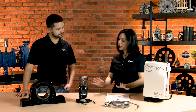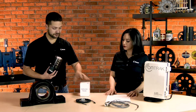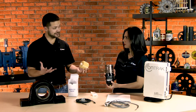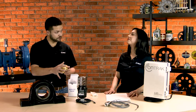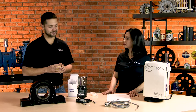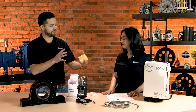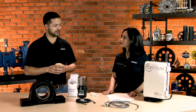So where does the grease come from? This single point lubricator, like many others, has a grease cartridge. Here we have it coming in a service pack — this is where you get the initial amount of grease. Every time you need to add more grease, you'll get a package like this that comes with a new battery and a new grease cartridge. Once it's installed, it's completely closed off from the environment, so contamination is minimized. It's marked properly so the right grease goes into it — you're not mixing different kinds of greases. Bad things happen when grease is mixed, as the thickeners of two kinds of greases are typically not compatible. Having the right amount of grease at the right time in the right volume also minimizes the potential for grease oxidizing, thickener dry out, and oil bleed, which can get even worse with the wrong kinds of grease added.